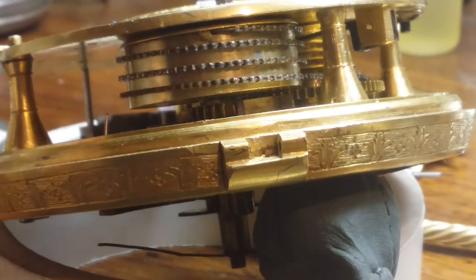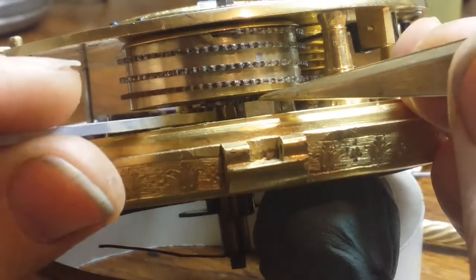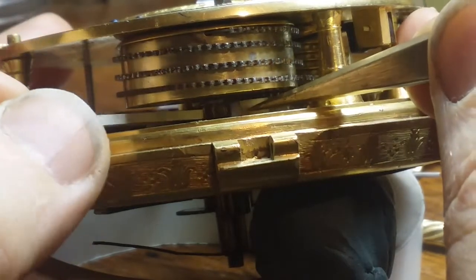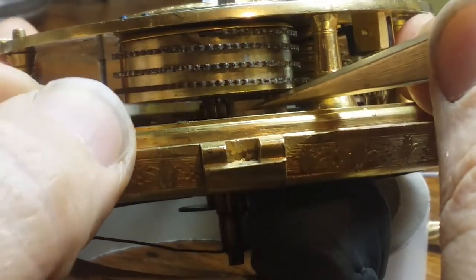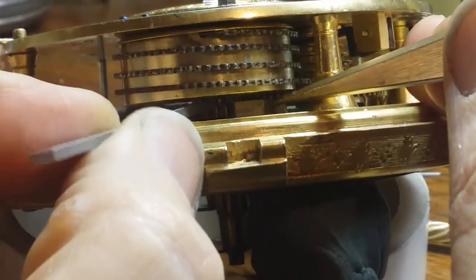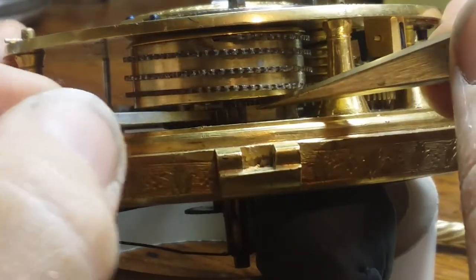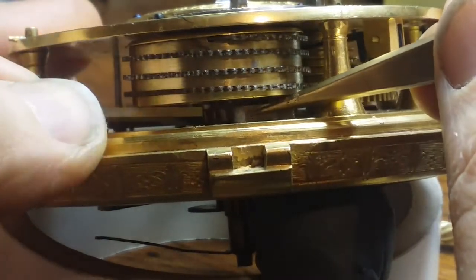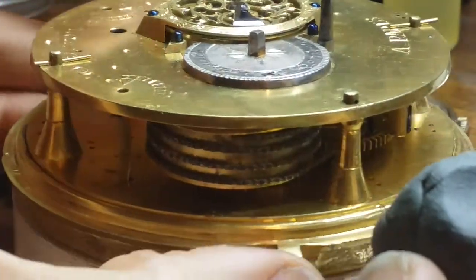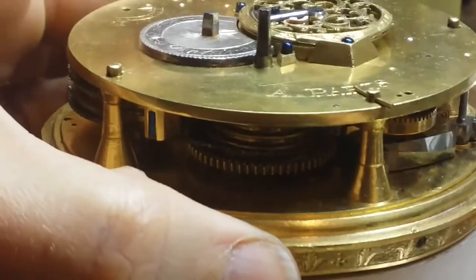Once you have the piece fully assembled, on a fusee there needs to be a little bit of power loaded on the fusee chain even before you wind it. That's where the ratchet wheel and the click that I had previously mentioned come into play. Here I've made a little wrench and we're just moving it maybe three or four clicks, just to put enough power on there so that when the mainspring is towards the end of its running cycle there's still power loaded on the mechanism. As you can hear, it is ticking — so even near the end of its cycle there is power on the mechanism, which is what we want.